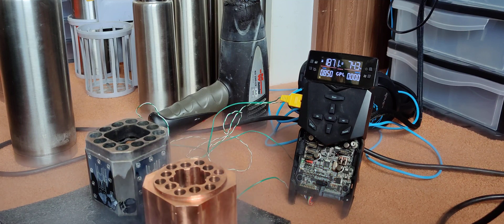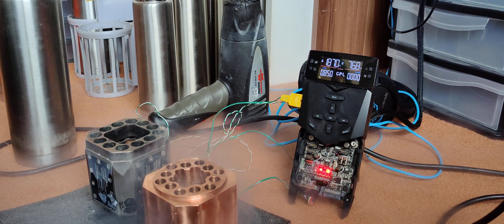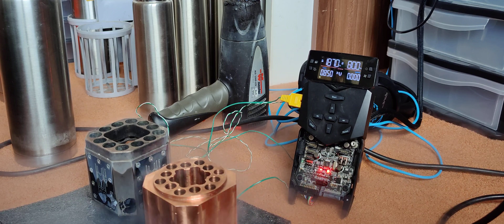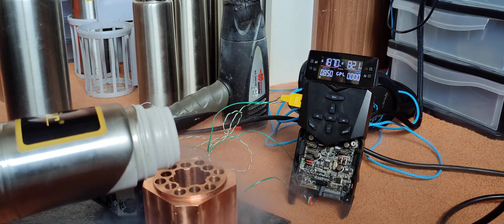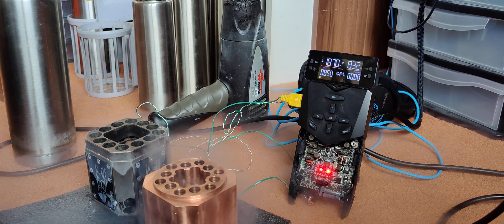That chip also has a cold bug because of the internal voltage regulation. Thanks to this, the chips won't go to full pot — they will just shut down and won't work anymore. We call this the CB or cold bug. Once the CPU reaches the cold bug, it just freezes and won't start again.